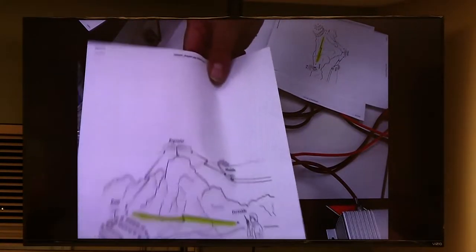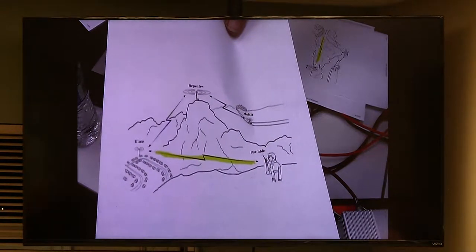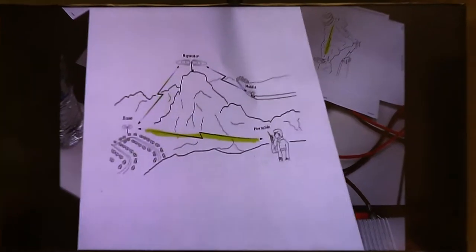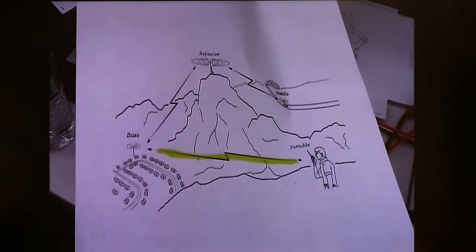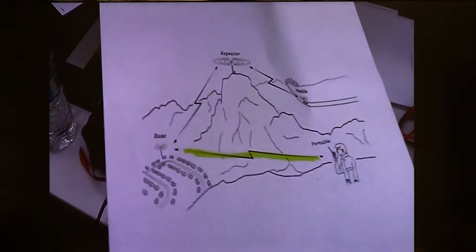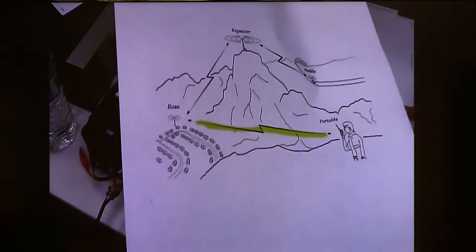You don't need your PL, you don't need your decode, you don't need your offset to typically use on Simplex. Because when you go to Simplex, you're typically out doing an event or something, and it's everybody just, hey, go to that frequency, let's hear it. And in your case, I think that would probably be the case, because different people show up with different radios.